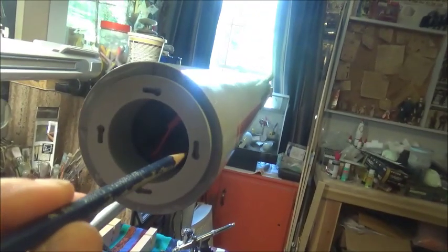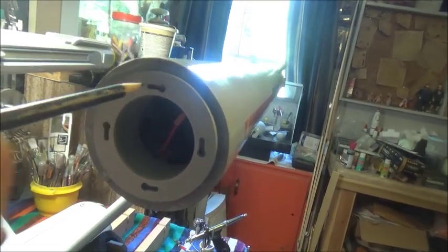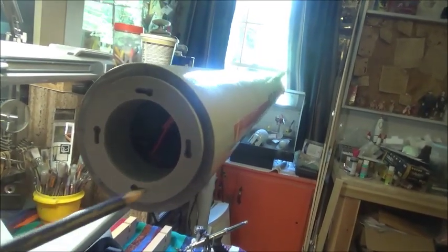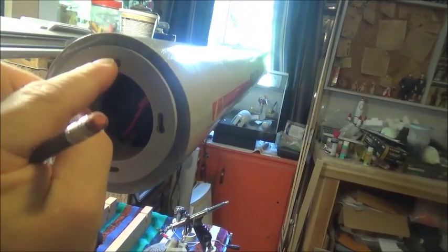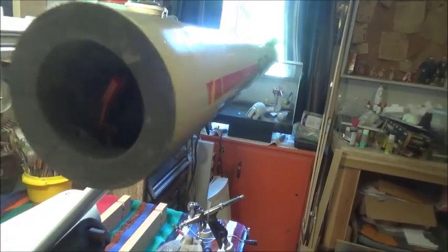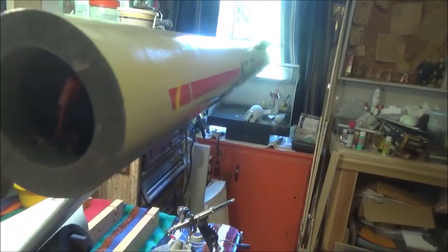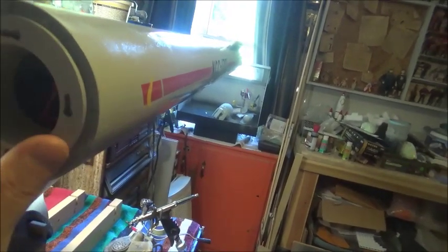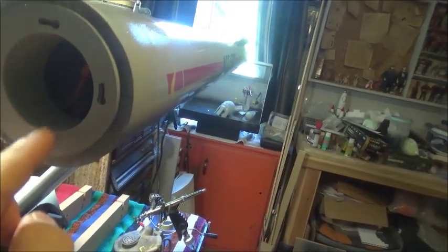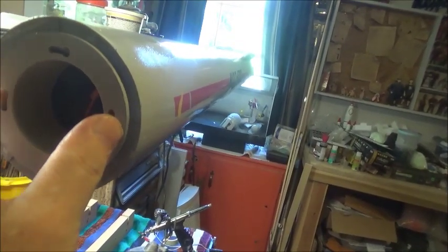And when I do that, I get plenty of meat on here and here, but not where I need it. What I want is two opposite holes, not two side-by-side holes. And when I say meat, I need to have enough fiberglass, resin, whatever, behind it to sink a screw into. And I can do that really nicely here and here, but not here where I need it.